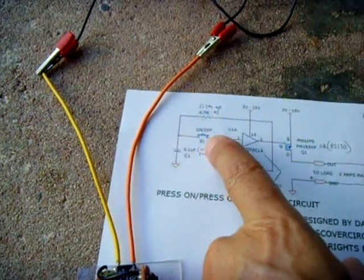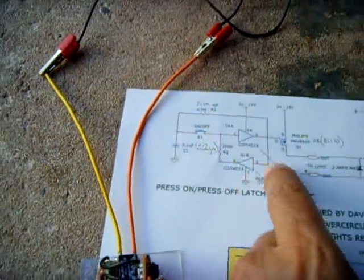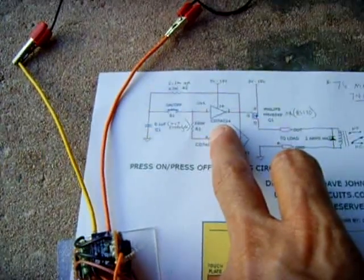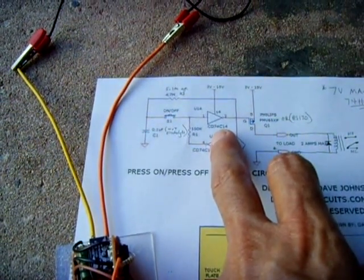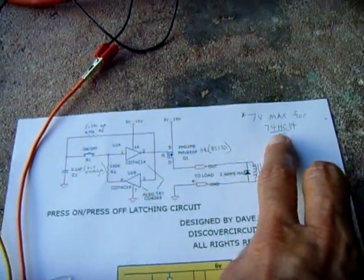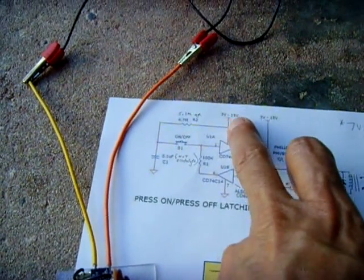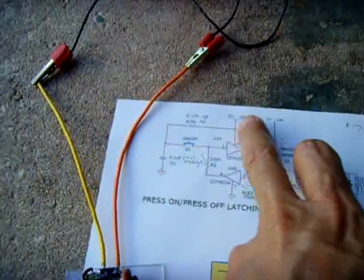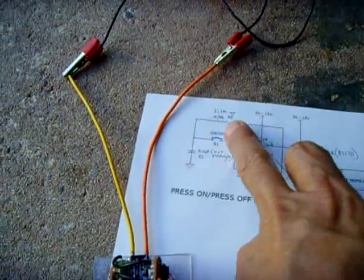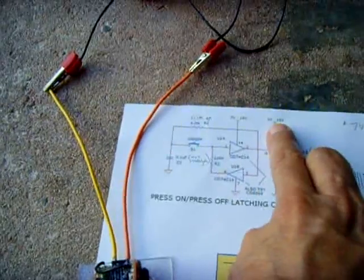Each side of this switch goes to the relay coil contacts. I used a 74HC14 integrated circuit, which is a hex Schmitt-trigger inverter designed for seven volt max. So I also put a resistor on that rail heading to the 12 volts to limit the current going in so I don't fry that integrated circuit.